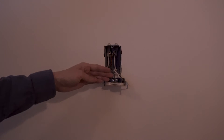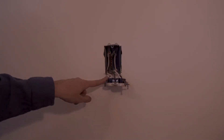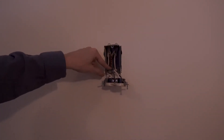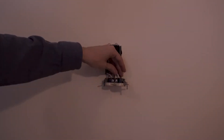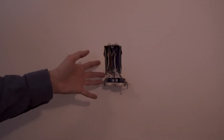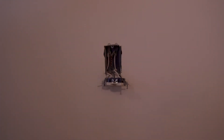What you'll notice here is that on the back side of the outlet, we actually have five wires coming into it. The bare wire is just the earth ground. We have two whites and two blacks — the blacks are the hots and the whites are the neutrals. One black and one white are carrying power from the circuit breaker box into this outlet. The other black and neutral are branching off to give power to another outlet that's basically in parallel with this one. To install the GFCI outlet, we need to know which set is the line and which is the load.